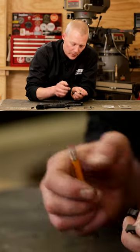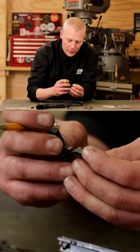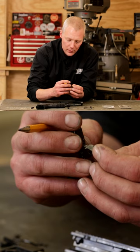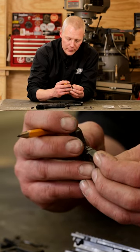What we're going to do: I'm not going to mess with the notch here because that's a very critical safety point, so I'm not going to be polishing any of that. What I am going to be polishing is the surfaces right here where that sear rubs against the top of it.